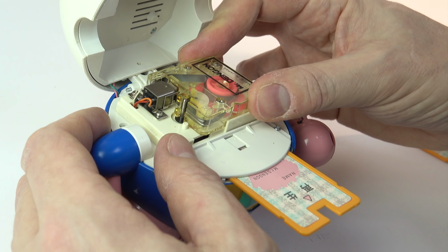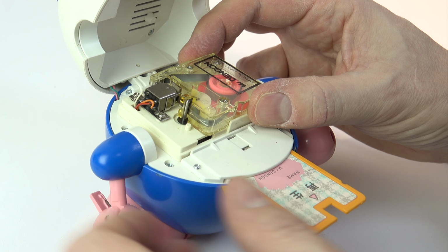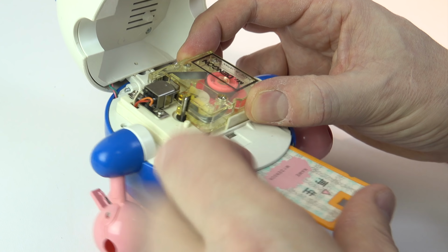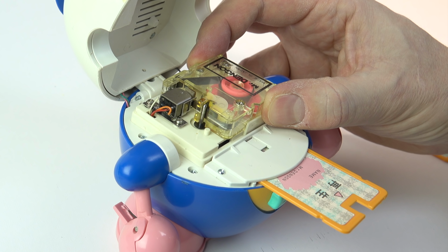The machine struggles a bit to turn the tape if you push it against the capstan too hard, and that will be because of the worn belt in there. It's no doubt slipping, but I didn't have a suitable replacement to hand. But if I hold it in just the right position, I'm able to make a test recording.